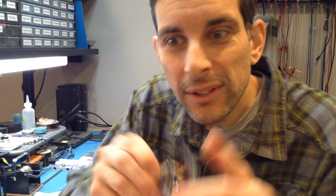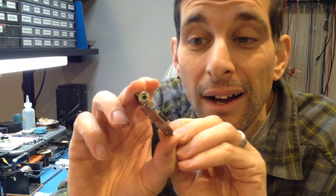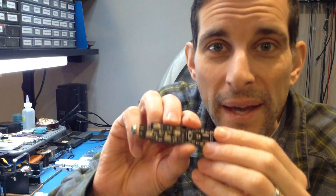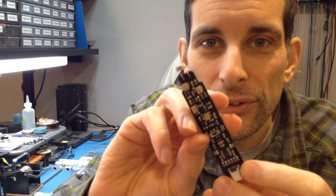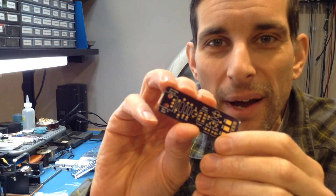There's the original digital receiver, an analog receiver with a photodiode and analog amplification circuitry, another analog version with potentiometers so you can adjust the various gains and threshold voltage, and even a fully assembled streamlined version with a built-in FT231X USB-to-serial adapter. These were sold through CrowdSupply, and then there's the new revision B of the OpticSpy digital.